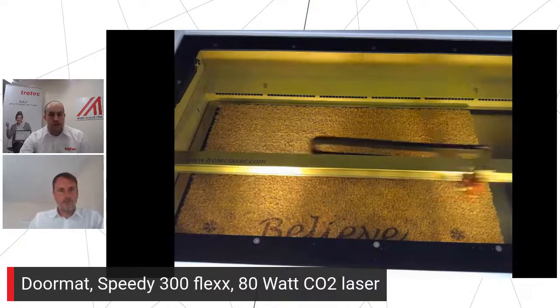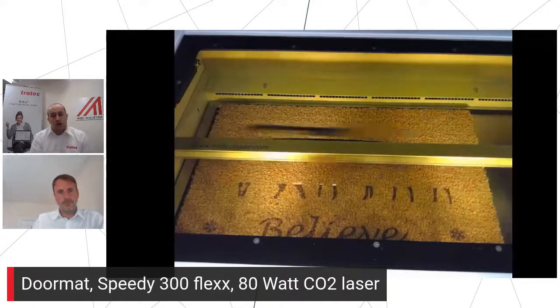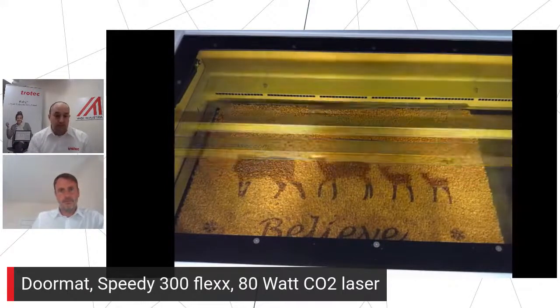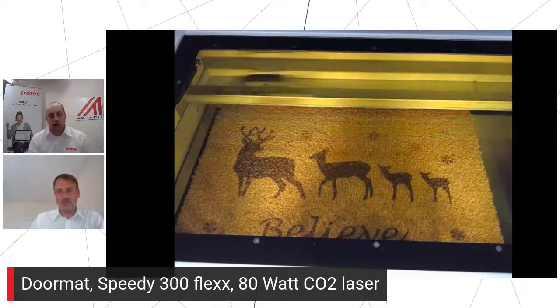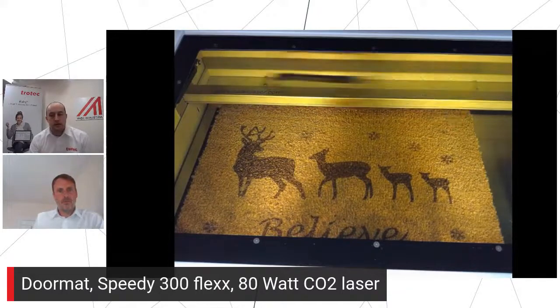What we're running is our Speedy 300 on this one. A couple of things really stood out for me — I ran it with an offset again, as Craig said, run it slightly out of focus, so I ran it with a 3 mm Z-offset. I ran this at full power and full speed with the 80-watt CO2 ceramic core. But the big difference I found was actually running with the air assist switched off when engraving. On this product — coir, or coconut matting — normally with wood it will vary, but we tend to have air assist on and off for various applications. But it really made a big difference to have the air assist switched off.